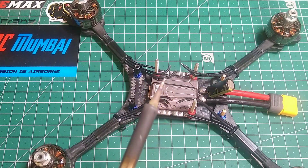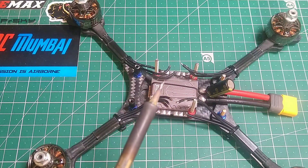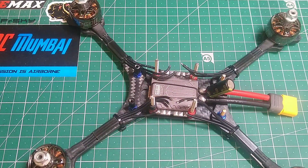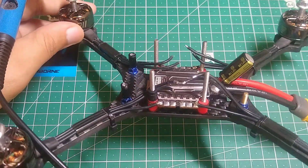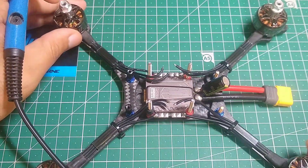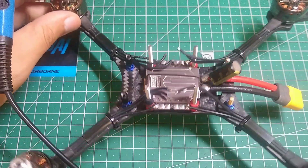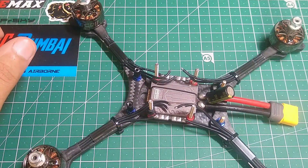Now the most important thing is that we need to get rid of this solder on the tip, because this solder has no flux inside it. If you use this tip with that solder on it, it will destroy the finish and you will not get a nice result. So first we need to clean the tip. Now, here you can see the cold joint I applied — it will easily come off if you try to remove it. This is just done to make sure there is enough solder and enough flux on the pad.